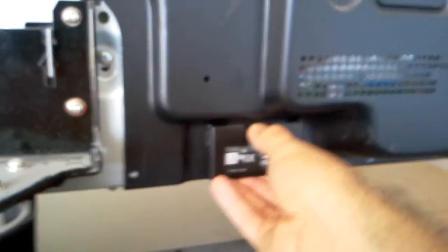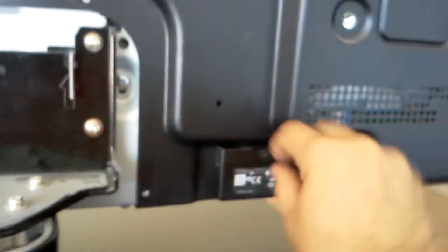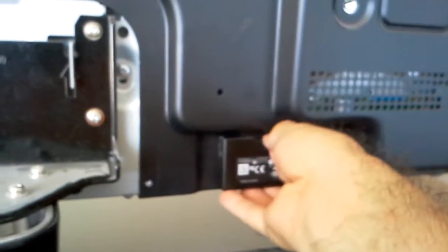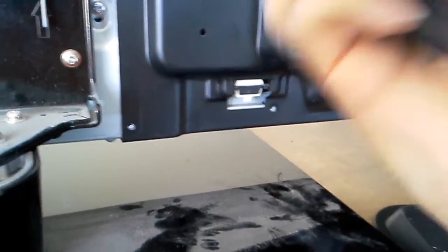You've got to take out this screw and remove the Bluetooth module by pressing and pulling it, then pressing down. You push or pull — push without the tab and push down. This is something you need to take out; it's just pluggable. There's a latch here — you've got to pull it out and push down in order to take it out.